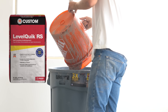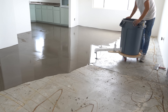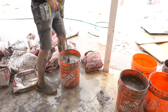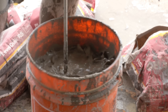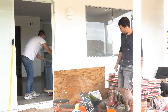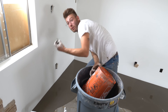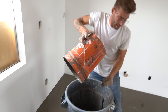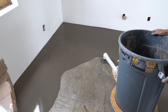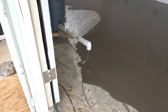There are a couple different reasons that I chose the self-leveling concrete I did. Number one was color — I read on forums that this had a good gray charcoal color. I did a test bag before buying a bunch and it did look good. The second reason was price — this is in the lower medium price range and Home Depot does offer a bulk discount. The only bag cheaper at Home Depot is from the Sika brand, which is a little more brown or tan. I wanted this museum gallery look. If you have clumps that you can find, get them out before they dry. I'd recommend installing some kind of strainer inside the trash can before the concrete hits the PVC spout, so clumps are completely avoided and you can just toss them out each time you reload.